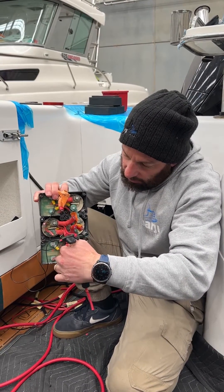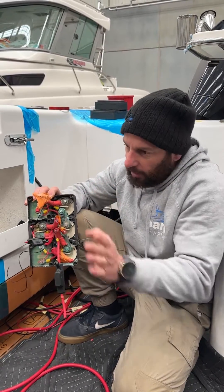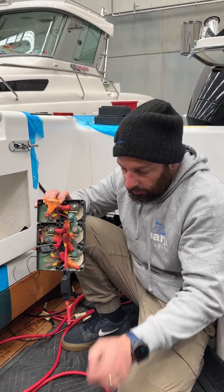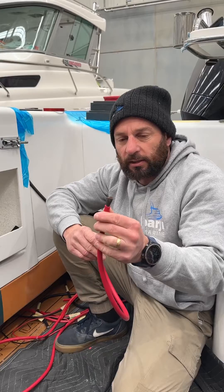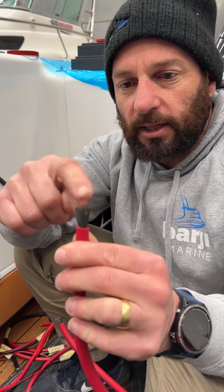What's happened is saltwater's got into this cable. This is the main cranking cable going to one of these V6 Mercurys behind me. So we're in the process of fully rewiring this boat and what we do is we strip these cables back and see the quality and the condition of the cable — see how far the salt's got. We're quite shocked on this one. This is actually a tinned marine cable but because saltwater has been getting in, you can see that cable's all corroded.